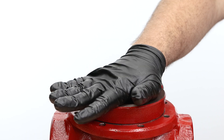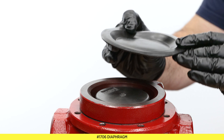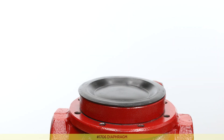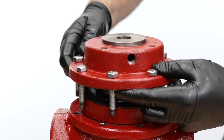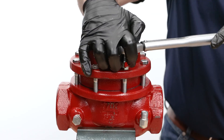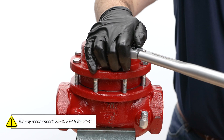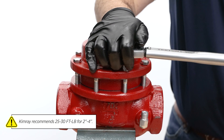Be careful not to pinch your fingers; push down the diaphragm plate directly on top. Install the main diaphragm onto the lower housing assembly, bevel side down. Place the upper housing on top of the lower housing, aligning the breather plug port between the outlet holes in the body. Start the bolts by hand, then fully tighten them using the torque star pattern. For 2 inch, 3 inch, and 4 inch regulators, tighten to 25 to 30 foot-pounds.